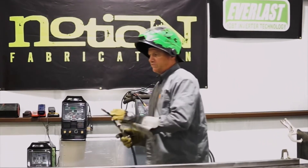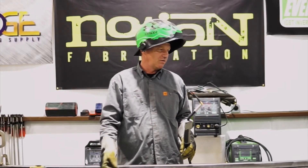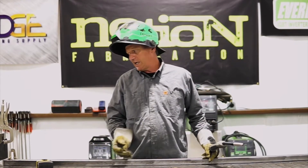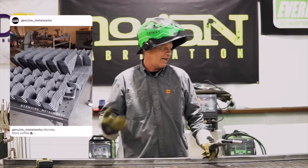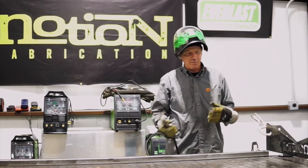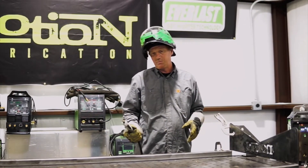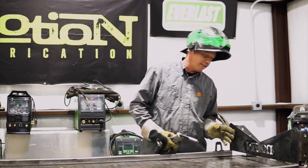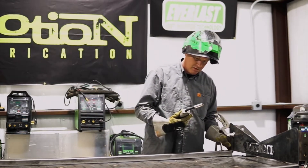I've got my rough assembly fixed up. I've got a table that I cut on the plasma myself, along with Koi Fab — tap and slot style, super handy. I've also got my genuine speed squares, which help in setting everything up and making sure things are 90 degrees. If you don't have the table or the speed squares, don't worry — you can get away with just a plain steel top table and a speed square. So right now I'm just going to go through, tack it, check squareness, add a few more pieces and weld it out.